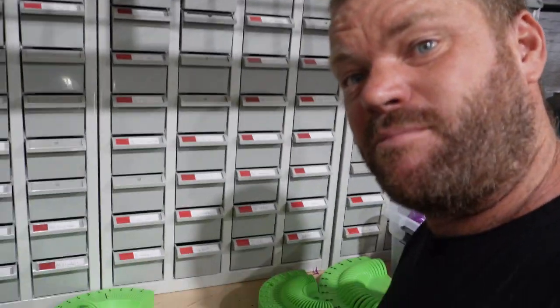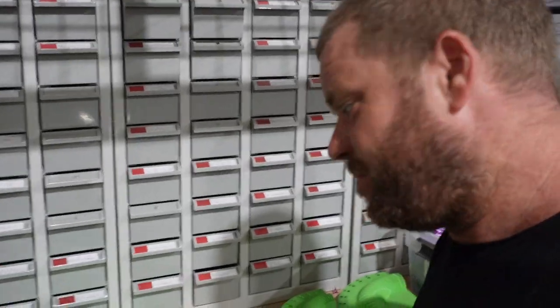Also designed up these little protractor things for marking out tube. So I've done it in the 1.75 inch and all the different centre line radiuses. So I've got 2, 3, 4, 6 and 1.5 times diameter. Same with the 2-inch, 2.5 inch and 3-inch. So I've sort of drawn all them up.